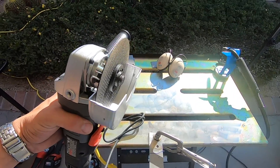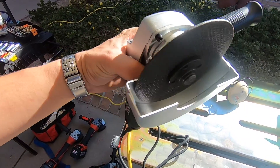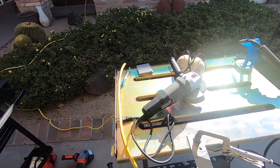I am going to use just a cutoff wheel. Now if you notice on this grinder I actually have two guards — this is a cutoff guard so if the wheel comes apart notice how it's got this bottom area right here. Also notice I got my hearing protection, so make sure if you're going to use a grinder or any power tools — I shouldn't have to tell you — use the appropriate safety methods. I don't use gloves with grinders, that's my personal preference, but be very careful. Eye protection, ear protection, make sure no one's around and watch where your sparks are going.